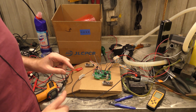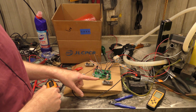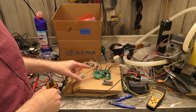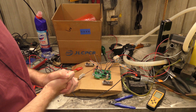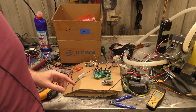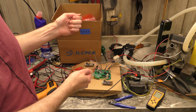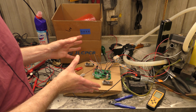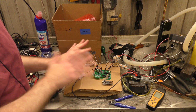My first tip: don't plug in the USB cable to your Adafruit without the main power being applied to the board, because the heater will try to run from the USB port on your computer. Hopefully your computer has a 500mA limited supply and you don't destroy it in the process, but it will try to run the glow plug and all the pumps and heaters off the 5V supply. So connect up your main power first, then attach USB, and in reverse: take out your USB then disconnect the main power. You only need the USB for programming and monitoring. Once you've programmed and got it running, you don't need the USB ever again.